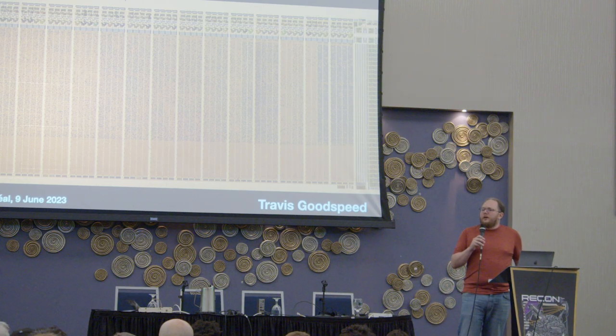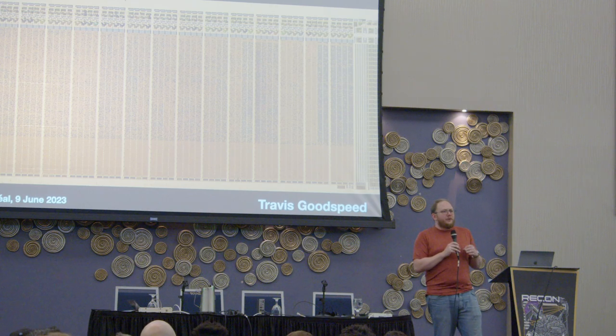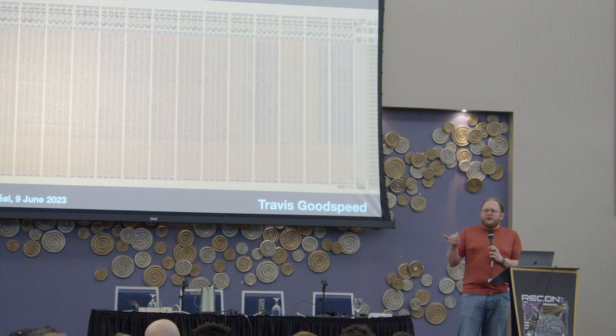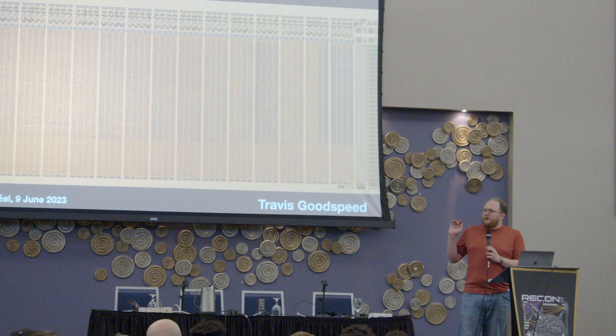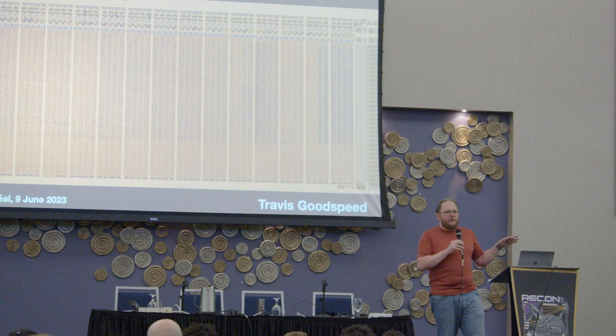There's been prior work, most of it by Matt Blaze, on how this card works, how to write drivers for it, and potential ways to get around these restrictions. There's a 16-bit checksum that is the only thing really validated as far as the key escrow goes. So if you can brute force a collision on that 16-bit checksum, you can get a secure connection even though you're lying about your participation in the key escrow system.